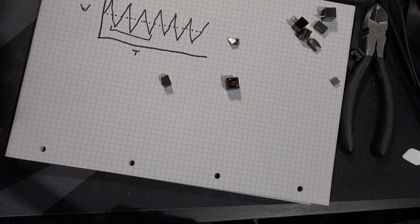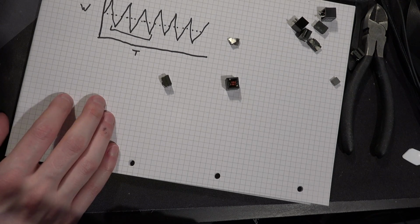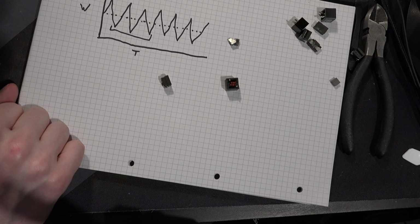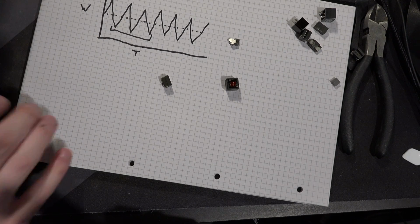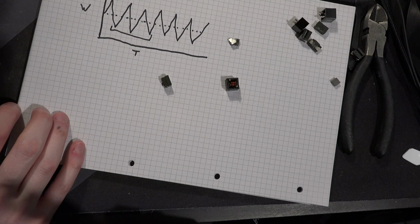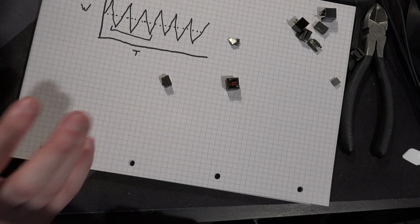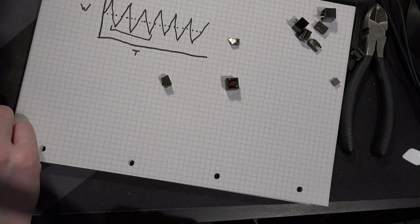Anecdotal evidence is not great, but the fact that Power Color used to put hot glue on some of their 290Xs, I think, is a pretty good indicator that that's probably your best option for trying to minimize coil whine, or to try putting thermal pads to dampen the inductors somehow. Basically you need to somehow mitigate the vibrations, and there's only so many ways to stop things from vibrating.